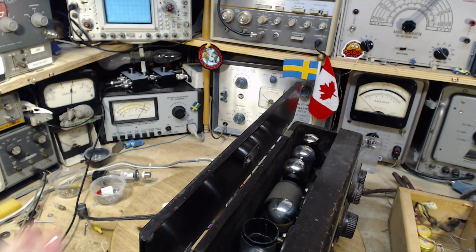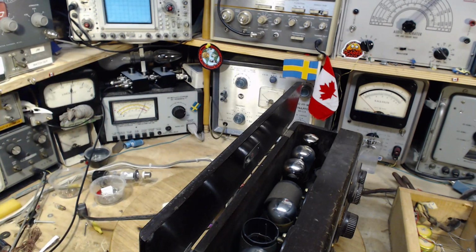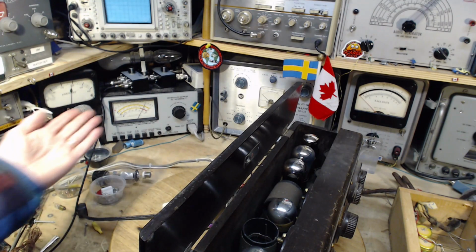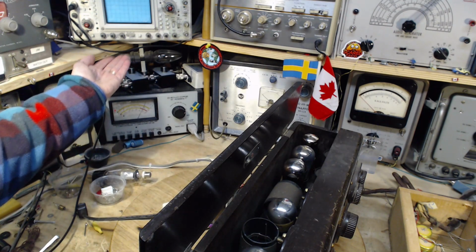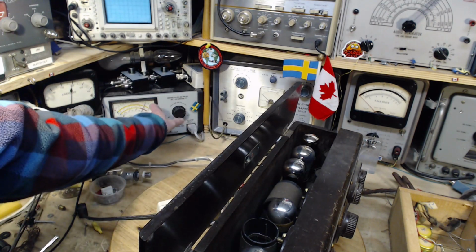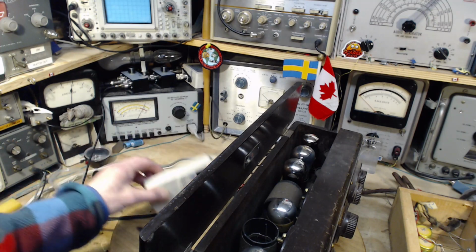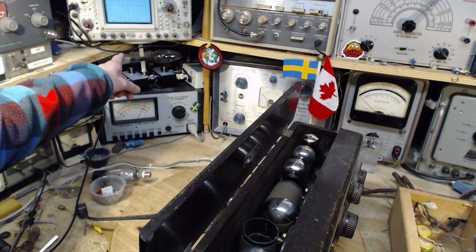They also provide a certain amount of feedback on the operation of tube devices during warm-up, by the pattern of the glow in these light bulbs. And lastly, I can leave the light bulbs in the circuit. They'll drop the supply voltage here. I can compensate by turning up this and get a full supply, 115 volts on here, still going through the light bulbs.